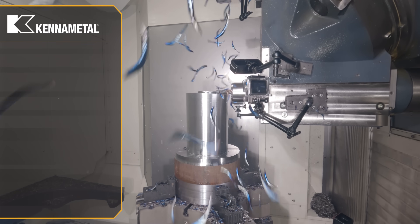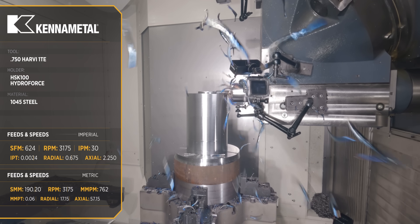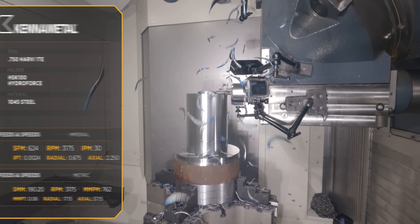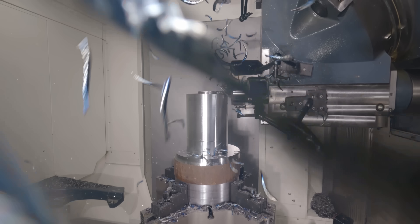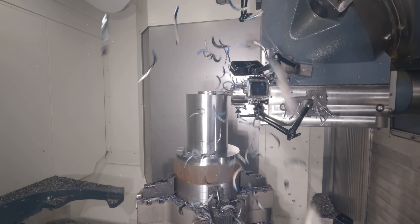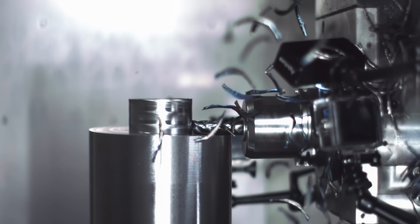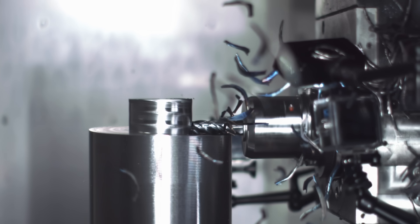Now it's time for us to start getting aggressive. We're going to come in with this tool at a full axial depth at a 90% step-over at 30 inches a minute. Our material removal rate is going to be 54 cubic inches per minute. For both of these cuts that we're doing with these end mills, we're only using about 50 foot-pounds of torque, compared to the 500 that we were using while turning.